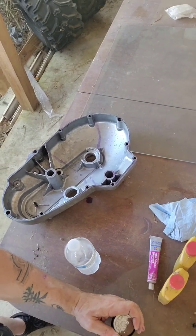Periodically check it — see if you've got any purple left, and if you do, keep going. See, there are some dings too. Right here it's starting to get really shiny, but there's still some purple right here. That's pretty shiny — this was a little further forward than the outer edge, so I'm just going to keep swirling it around till it's nice and flat.